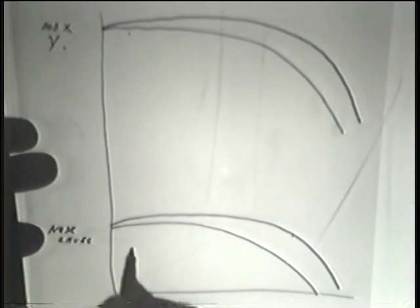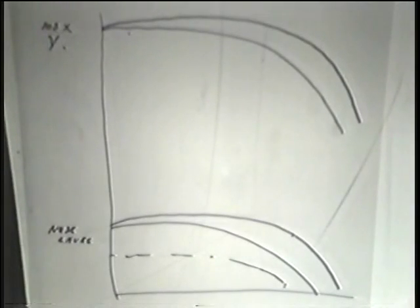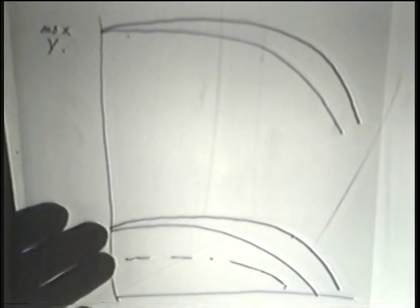Well, since we don't need all that anymore, our noise level is much lower with our newer tapes, we can do away with this boost signal and the noise canceller, and that's what that detail switch does, basically. Again, it's a small thing, but added together, they all add up to SuperBeta. So it operates in record and playback, the detail switch? Just playback. Yeah, just in playback.